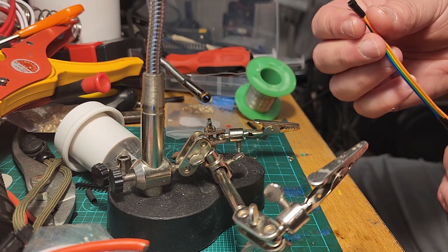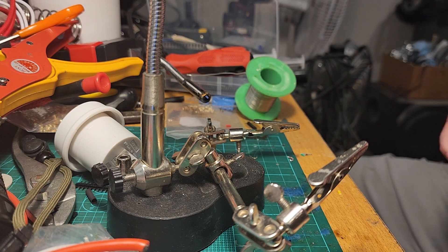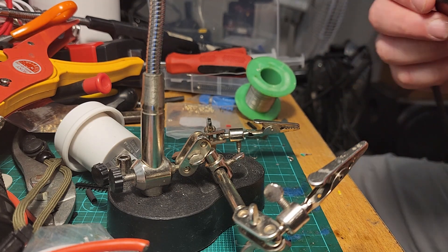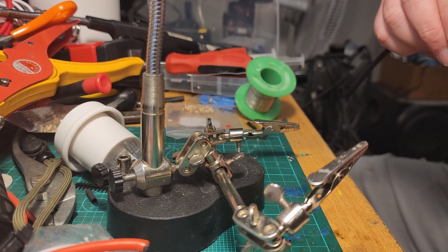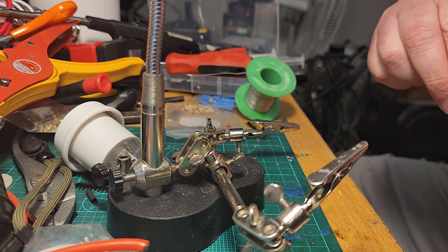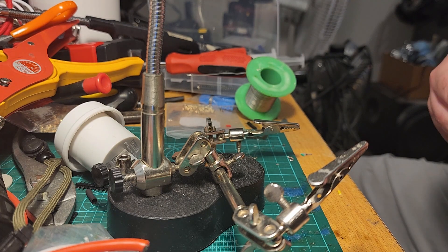So now we have a joint which is reasonably sturdy. We've got the pins so we can connect onto the H-bridge motor driver; at the other end it's just wire which we'll trim to the right length and put into the connector. Next part is taking some braid to tidy it up. One catch when you use braid — after you cut it, the very first thing you should do is grab an open flame and singe the edge; it just stops it fraying out. Then feed the wire into the braid — I find if you squeeze and pull it'll come through, then let go. Squeeze, pull, let go — it helps feed it on without catching on anything.